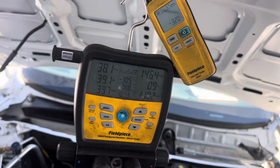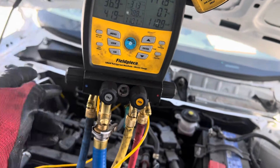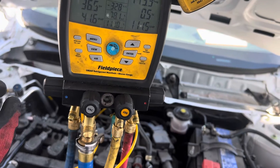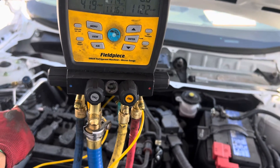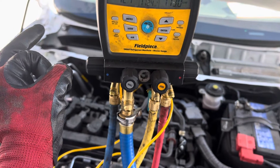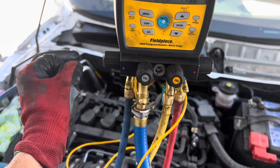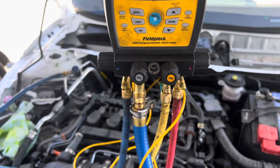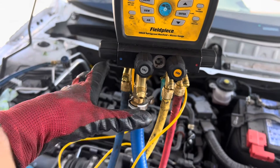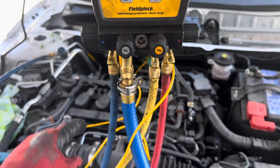Someone's going, oh my God, you're liquid slugging it — you're going to blow up the compressor, you're going to damage it. But that 30 grams I just filled up in the hose is at a higher pressure than what the suction line is. There's a valve core inside there as a restrictor, and it's not all going in as a lump. You can see how long it takes for this to flash off, lower in pressure, and finally distribute.